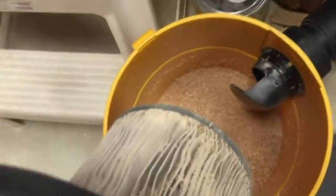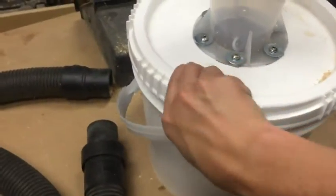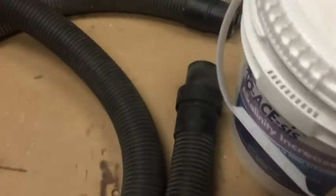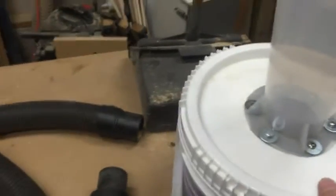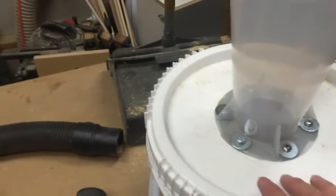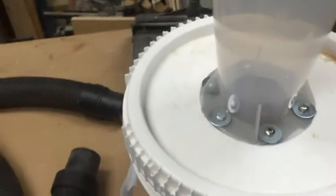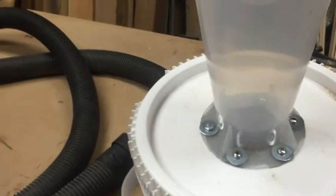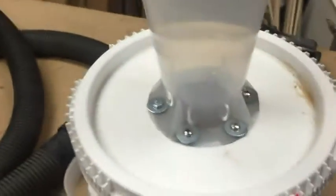The first thing we're going to look at is how much went into the shop vac — I would say almost all of it. Now let's have a look at the bucket — almost nothing in the bucket. So at first I thought it was actually working. You could see that it was getting clogged as it would go around, and then if I pulled the hose away from the sawdust pile it would clear the clog and start spinning around again. I thought as long as you went slow or if you were just vacuuming light dust like sanding dust that it would work. But it appears that you lose all the efficiency of what a cyclone is supposed to do, so you end up with a full shop vac and a full filter and nothing in the bucket.